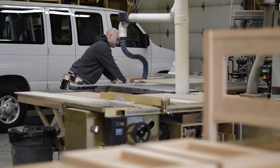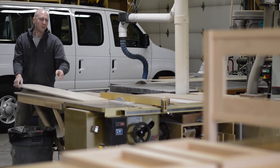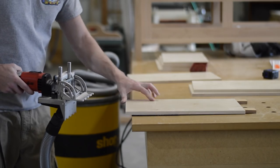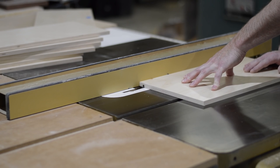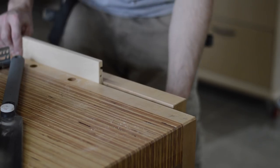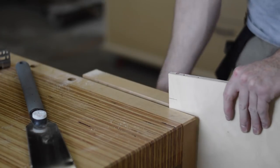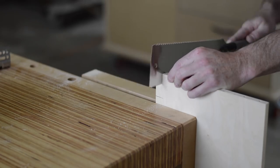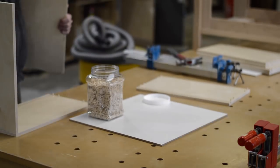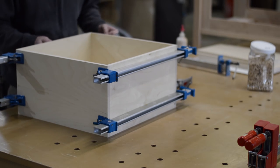After that it was time to make some drawer boxes. I like to use half-inch thick pre-finished plywood — the place I buy it from calls it Baltic birch, and it comes in 5x5 sizes, not 4x8. I hold everything together with 5mm dowels, four at each corner. On this project I'm using a drawer slide known as the Blum Tandem, and it requires a notch to be cut out of the back of each drawer box to create clearance for the undermount slide mechanism.